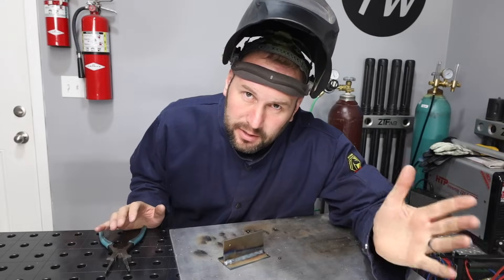This is where pulsed spray transfer comes in. Like regular spray transfer, you have the arc lit all the time, however you're increasing and decreasing the welding current over and over again electronically, rather than using that short circuiting mechanism. It's kind of like going from a carburetor to fuel injection. Using pulsed spray transfer, you can weld on thinner materials and in all welding positions.